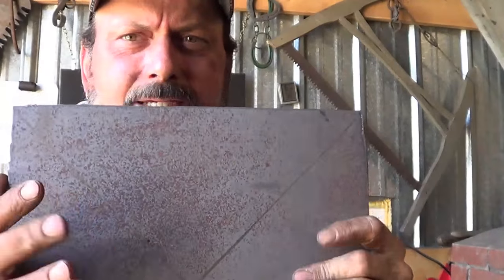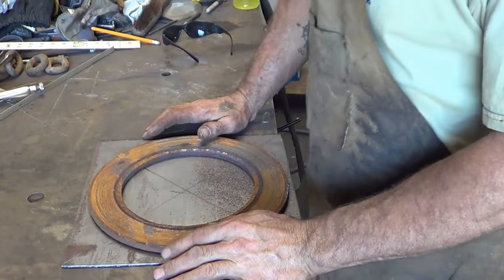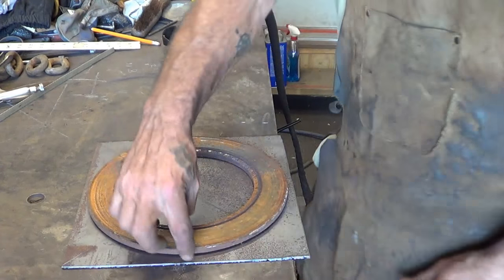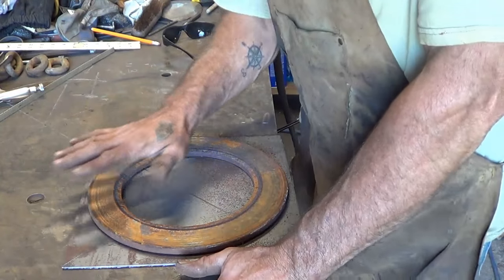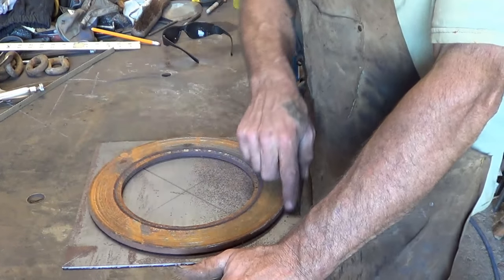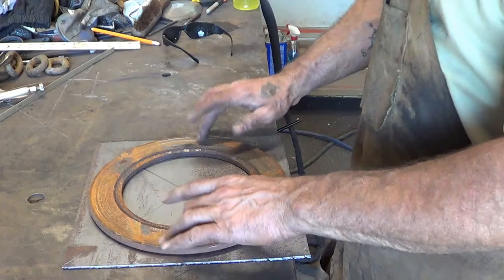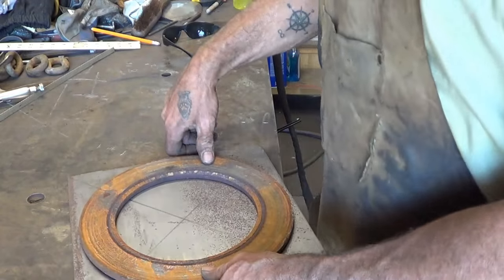This wasn't my original plan, but I picked this disc rotor up and it looks like it's just going to be just about right. My plasma cutter cuts about a half inch off the edge, and that's pretty damn close. This is the first time ever trying to do this. I would normally go get a piece of plywood, cut out a good circle, and use that as my plasma torch guide. But I think I'll center this thing up on here, figure out how to get it lifted up so I can cut on it, and we'll cut it out.